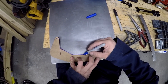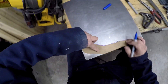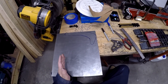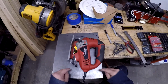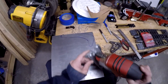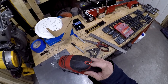Once I do this first one I'll use that as a guide to do the second one, since I'm gonna add different curves and my template's not gonna be perfect. Now it's secret time - a lot of people don't know this but a jigsaw cuts metal very well. You've got to use the right blade and the right settings. I also lubricate my blade periodically with a light oil - just dip it in there - and that's how I cool it too.